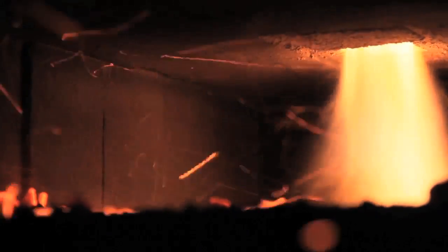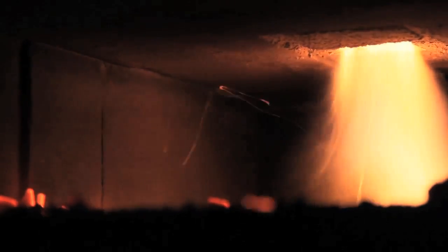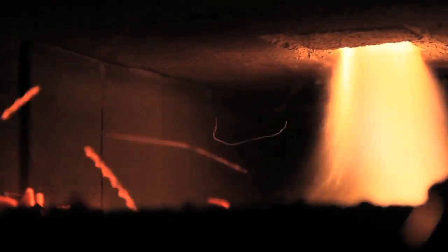A unique feature of the boiler I have is the use of a lot of refractory material in the bottom of the firebox and the reaction chamber. And besides lasting a long time, there's a good reason for this. There's 5 inches of refractory material that forms the bottom of the firebox and 4 inches that forms the bottom of the reaction chamber. This retains heat, and it means that the gasification process kicks in a very short time after the fan motor starts up as the aquastat calls for more heat.